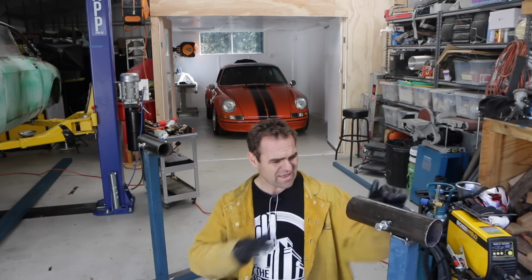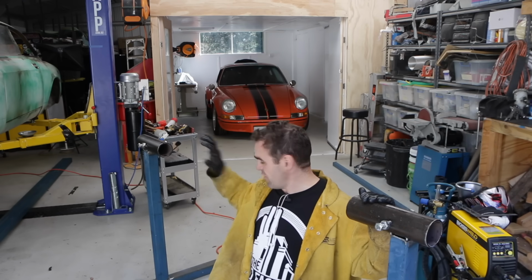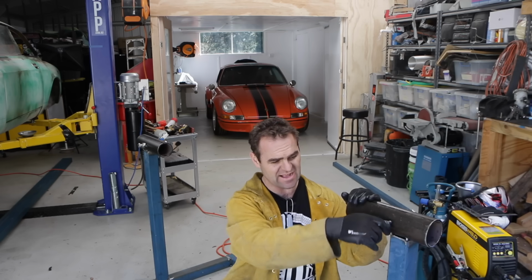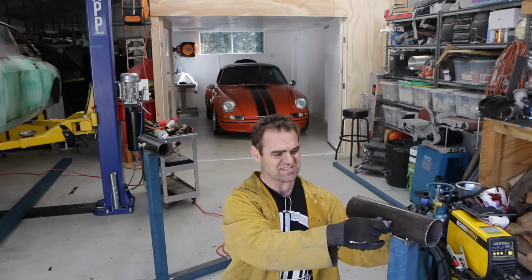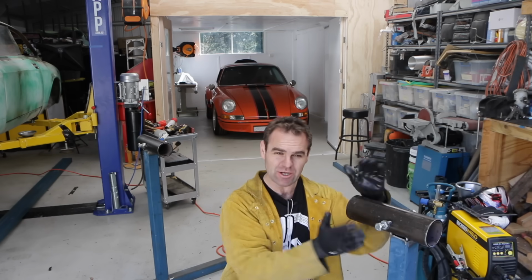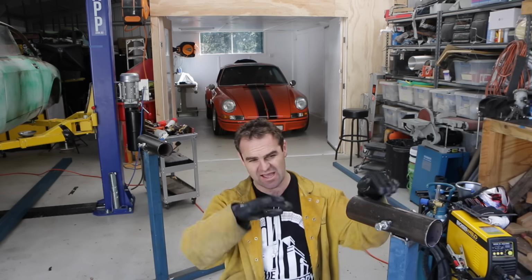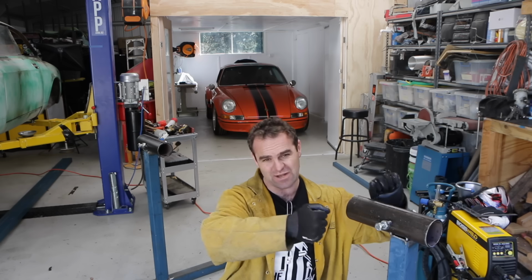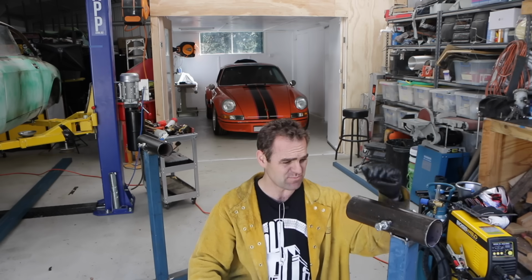All right, so I've got my rotating assemblies on either end, and what I've done is I've just tacked in so far captive nuts on either side. This is actually going to be what will lock the rotisserie at certain angles. As long as I've got the balance right, that works quite well, and that's actually how Tim has his rotisserie. Instead of a pin locking all the way through, I can just clamp down on the pipe inside, and it should stay where it is supposed to be.